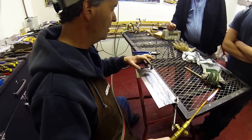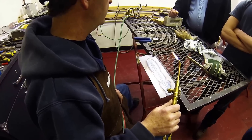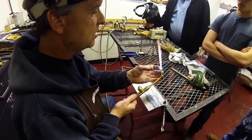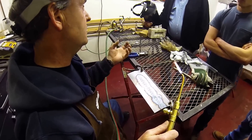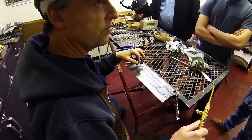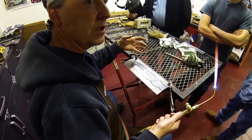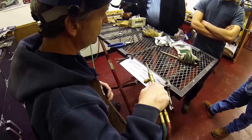You want to bridge — you don't want to wave your flame back and forth. That's a failure on the education part. You don't see me doing this at all. That flame is small enough and the material thickness is small enough that as soon as I bring it down onto the surface it's instantly melting within three seconds. The joint is so narrow — let's say you have a 10 thou gap — that flame is 1/16 to 3/32 wide, so I'm already naturally wider than my joint. I don't have to wave it; that's operator error.